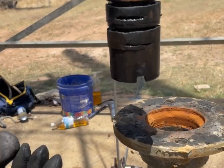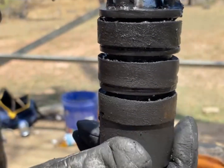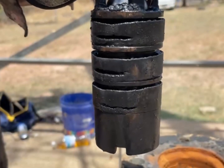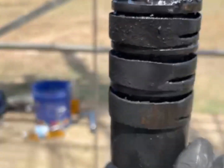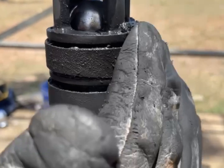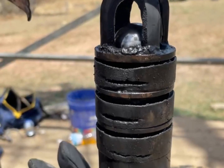We've been slowly getting less and less water and these washers have been running for about three years. You can see they're all good — they're still leather washers — but they've been rubbing on one side because this windmill bore is a little bit out of straightness. One way I can probably fix that next time, in about six months or a year, is give the whole thing a quarter turn and wear it in a different spot.